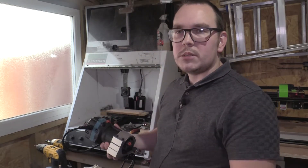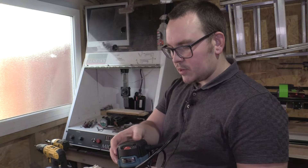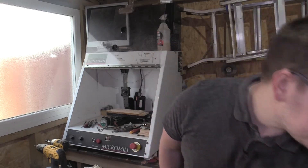For the power supply, I'm planning on using a 5-volt controlled relay just to turn on the 230-volt supply to the router. That means when the computer gets the command in the G-code to turn on the spindle, it'll turn that relay on. I'll probably just manually adjust the speed — the dial is numbered 1 to 6 and I'm not sure if that's 5,000 RPM increments up to 30,000, or equal increments from 15,000 up to 30,000.